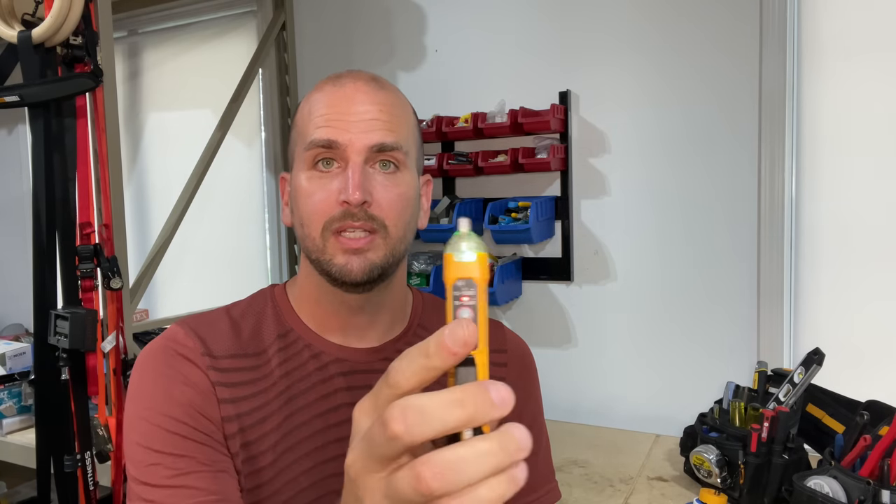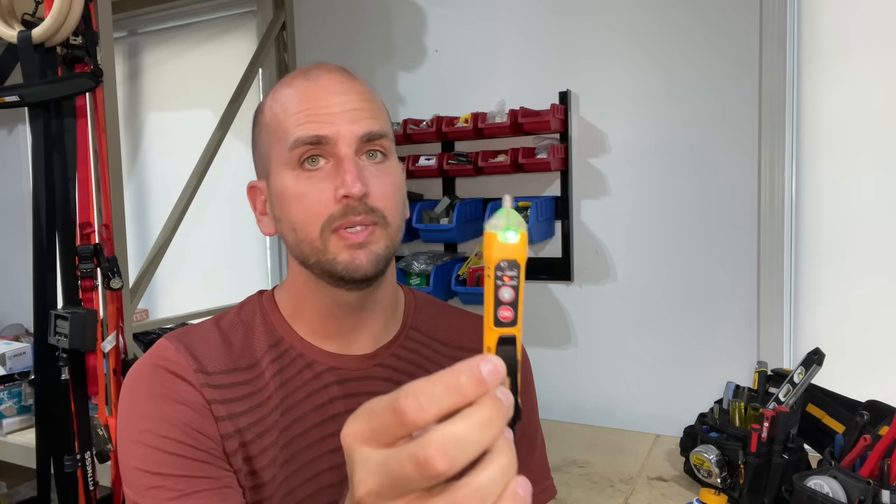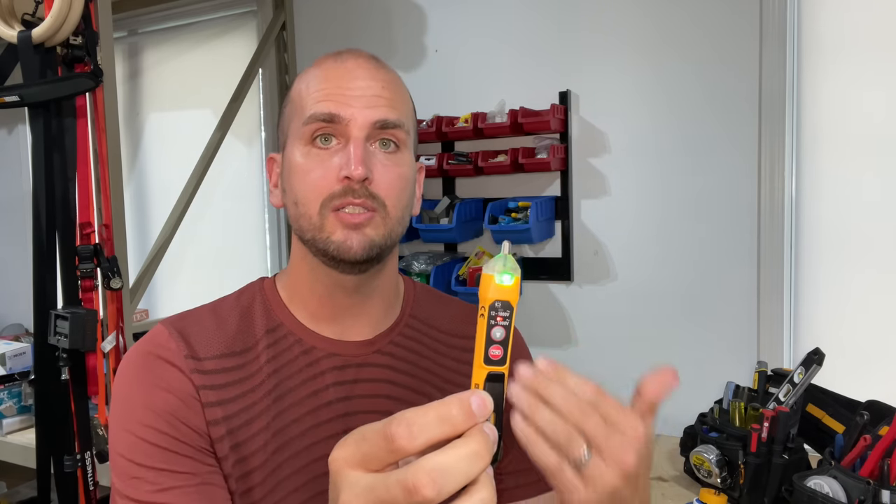Let's say you're a standard homeowner who uses this maybe once every six months or once a year. Your batteries go dead, so you turn it on and it runs for five to ten seconds before you actually test the receptacle, then the batteries drain out and it turns off. You're not going to know the difference — you'll think it's still on, test, get no audible alarm, and think the receptacle or wire has been turned off. But in fact, your non-contact voltage tester is giving you a false negative because it has no battery power. With the 3P, the green LED always indicates it has power and is ready to measure.